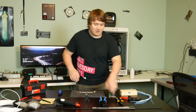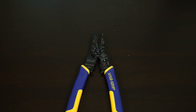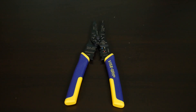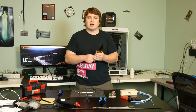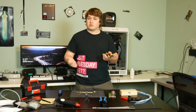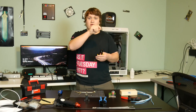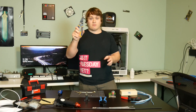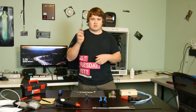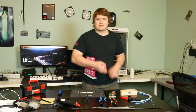I've also got some cable cutters, crimpers, and strippers here. Honestly I'm just using them for stripping cables. You could get a cheaper pair — you don't need a high-end one with all the measurements. You just need one that can strip 18 and 16 gauge wire, and preferably 22 gauge too just in case. If you're soldering wires together, you'll need this to strip the sheath in the center of the cable. Doesn't have to be super high-end — you can get them for about five bucks.